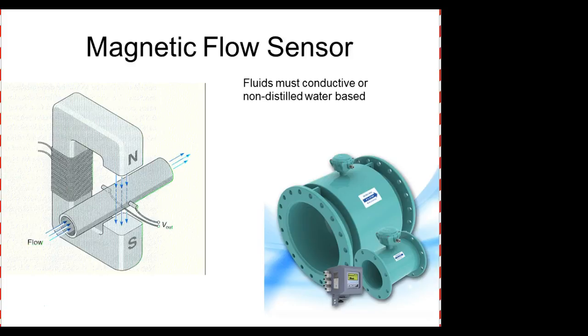So when this thing moves, how much voltage we induce into something depends on several things. It depends on what type of material we're using, right? It depends on the number of loops, or how much stuff we've got to absorb the energy. And then, of course, one of the main things is how fast it's moving.